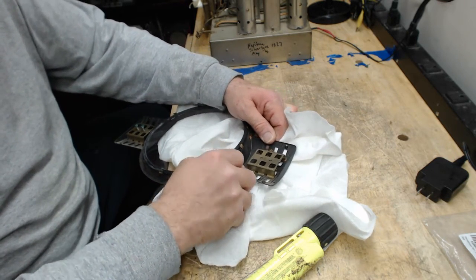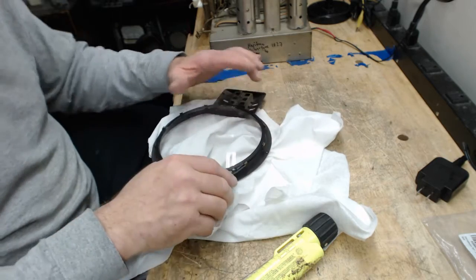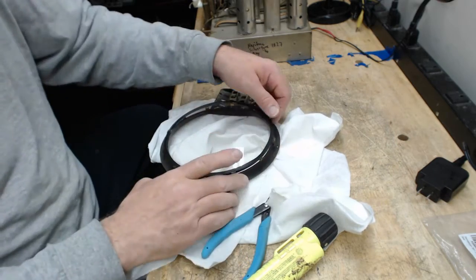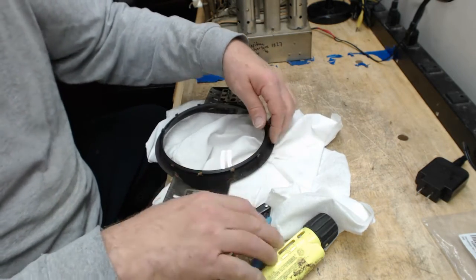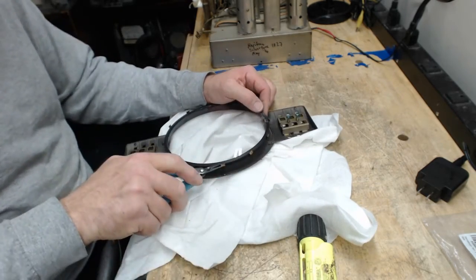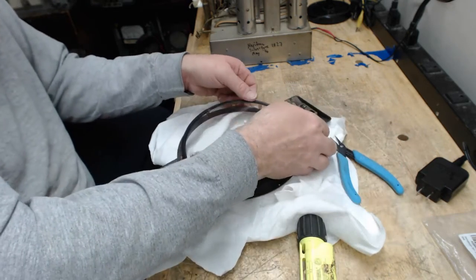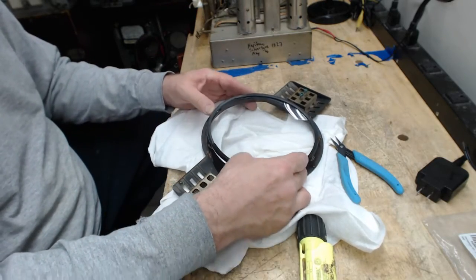So, that's all right. I'll get it there. Okay, if you bend them too many times, they'll break. So that's the problem. And taking this in and out of the fingers too many times will peel that rubber off the glass. This was such a crappy mounting scheme. I don't know, the Zenith people, brilliant radio engineers, but they weren't so good at the mechanical side. Their tuning mechanisms were over-engineered, and this thing here was under-engineered.